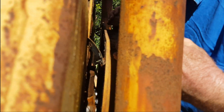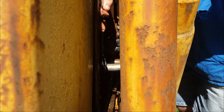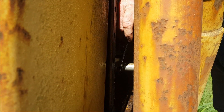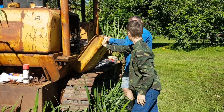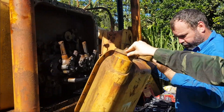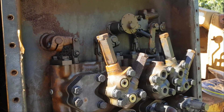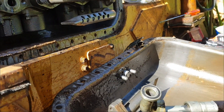There's a hose connected inside. Okay, we've just got a hose inside we've got to remove to let us get the outer shell off — it runs back to the filter. Okay, we've got that hose off now; the outer shell can come away so we can clean up inside, clean up the gasket, replace the sight glass, and start putting it back together.